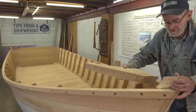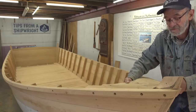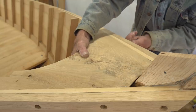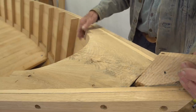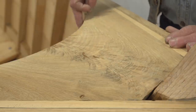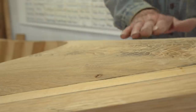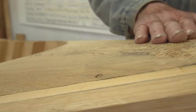We're going to put our breast hook in place right now. I've done quite a bit of work on it — I rounded the top with an electric plane, fit it with a battery-powered electric plane. In place, it just looks fantastic. Put a couple of screws in it just partly to hold it there. It is one handsome breast hook. These are the annual rings right here, centered right between the center of the stem and the center of the radius. It's just incredible that they'd be that uniform and pointed in the middle. I've also put a little crown in it because you want the water to roll off.